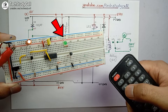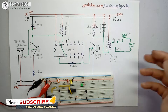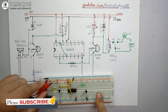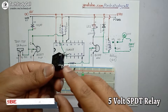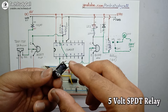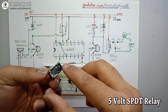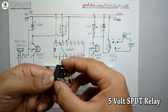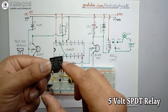Pressing again will turn it off. Now we will connect the relay to control the 220 volt supply with the help of this circuit. I am disconnecting the DC source. I am using this 5 volt relay — these two terminals are the coil terminals and these two are the NO contacts. When the coil terminals get supply, the two normally open contacts will close and current can flow through them, so this acts as a switch.